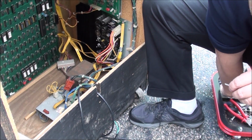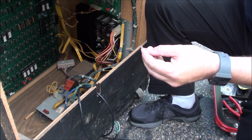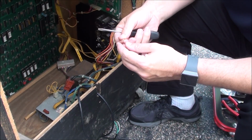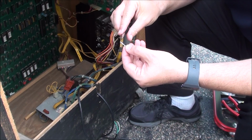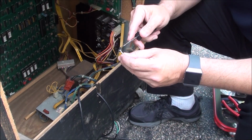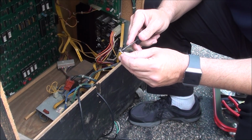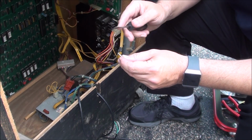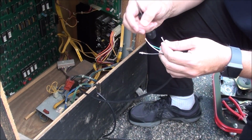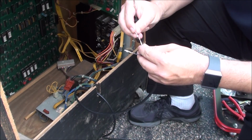And let's see here. You actually don't have a lot of wire stripped off. So this whole top part, the tube part, all the way down to there is empty. That's all empty. You leave it alone. The rubber insulation goes up to this part right here, and then this middle part, that's where the wire is, and it gets crimped. So it's a surprisingly small amount of wire at the very end. It's a very little amount.